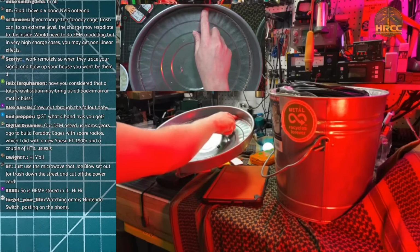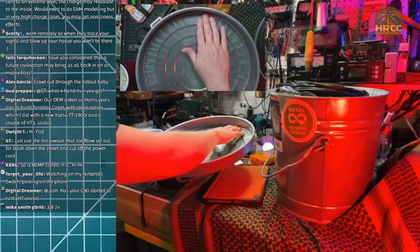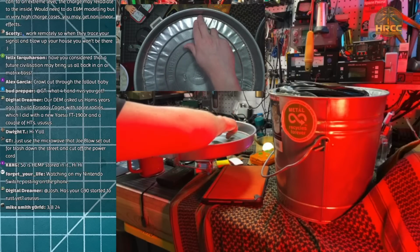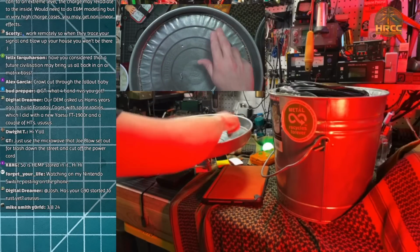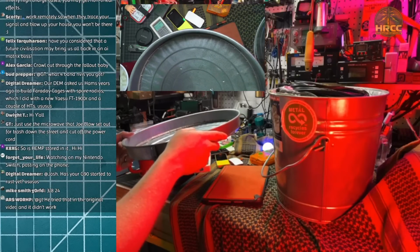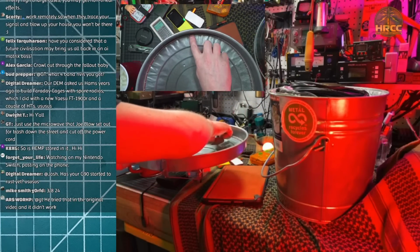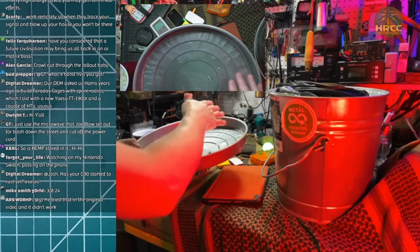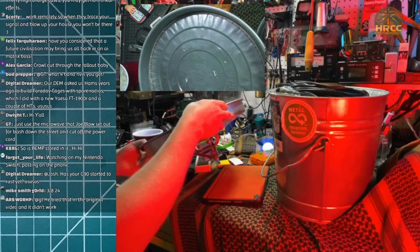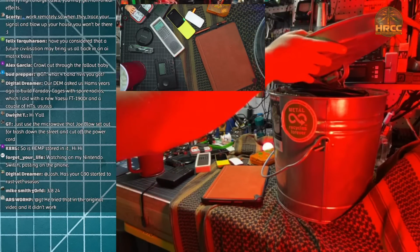This is a metallic mesh seal that goes all the way around, and when you shove this onto the body of the trash can, this is what provides your electrical cocoon seal. That's what seals everything up completely for when you actually get some kind of EMP. Having the can completely sealed to the body is what you're looking for. And yeah, I did do some brazing and brazed the ends there, so that seals those up as well. Rivet holes have been covered to a degree.